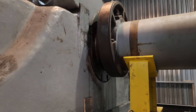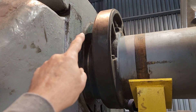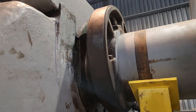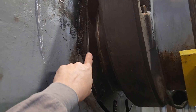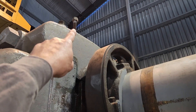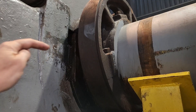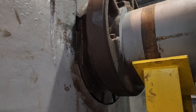The bearing is in four pieces: you have a bottom shell, two side bearings, and of course the babbit that's in the bearing cap. In order to adjust it, the only real adjustment is that you can bring the bearing cap down a little closer as it wears. You have these tapered plates here with a couple of pieces of all-thread — you bring those nuts down and that brings the tapered piece up, which forces the side bearing in.